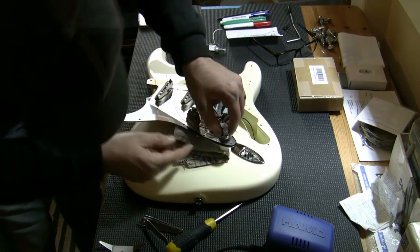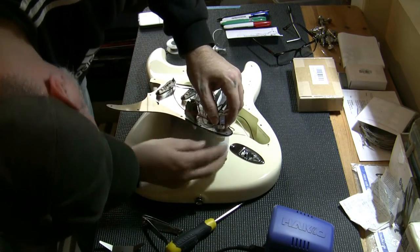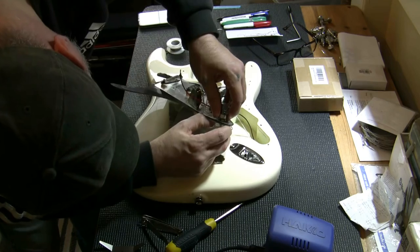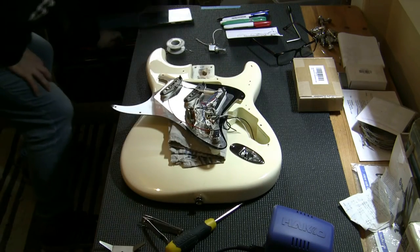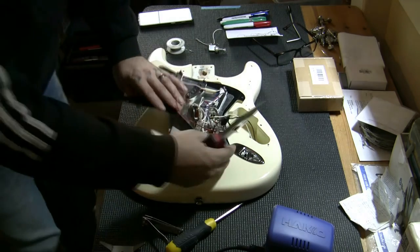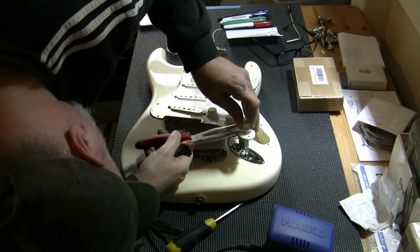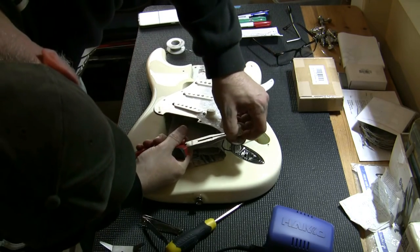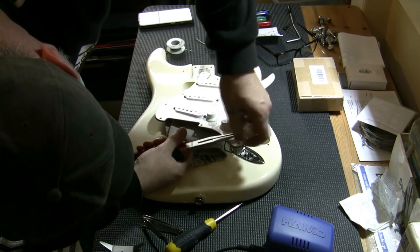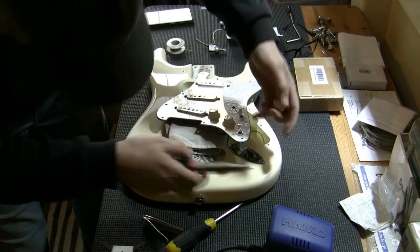All I really want to do is just lower this pot a little bit. So what I'm going to do is remove a knob. What we must always do when removing a knob from a push pot is we must grab the stem when it's in the out position. Otherwise we're going to pull the whole pot apart. See where I got hold of it there, look? And now that is still working.